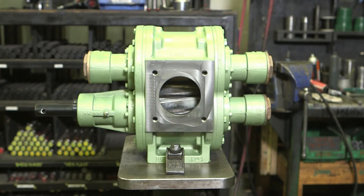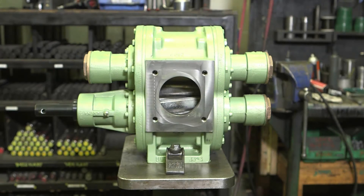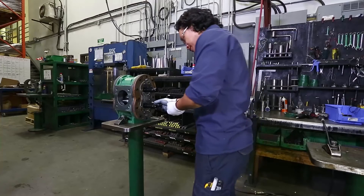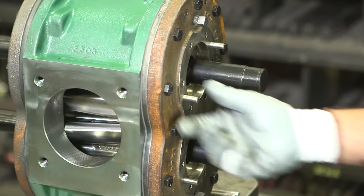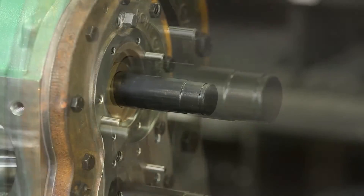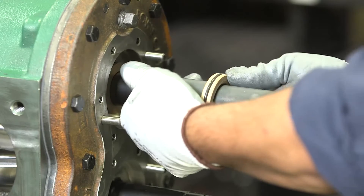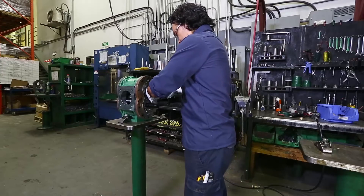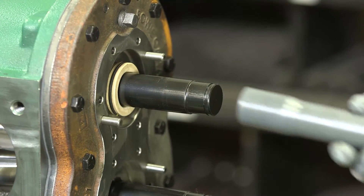Now we're ready to move on to the small end caps. There are three locations on your Duraceal pump that use small, rapid-access end caps. The steps are the same for each. When assembling a complete pump, be sure to assemble the end caps on the rear of the pump first. The first step is to insert dowel pins into the dowel pinholes on the end plate. Next, slide the bronze spacer onto the shaft with the flattened side facing the outside of the pump. Place the seal sleeve onto the shaft. With the lips of the seal facing the center housing, lubricate and gently add one high-performance lip seal to the shaft and push flush to the spacer, taking care to not damage the seal lip. Remove the seal sleeve.